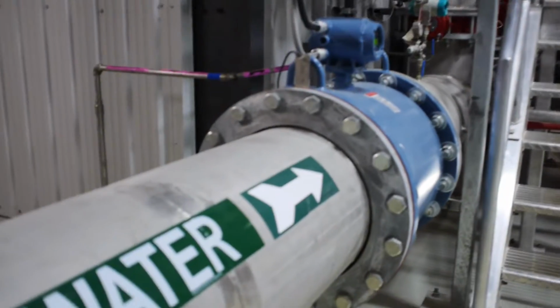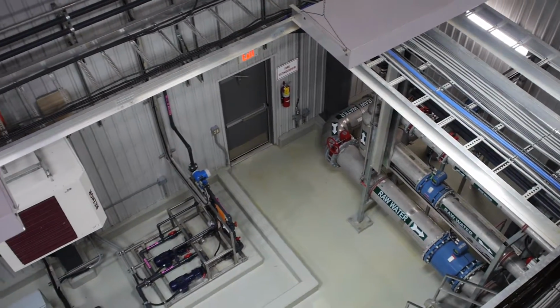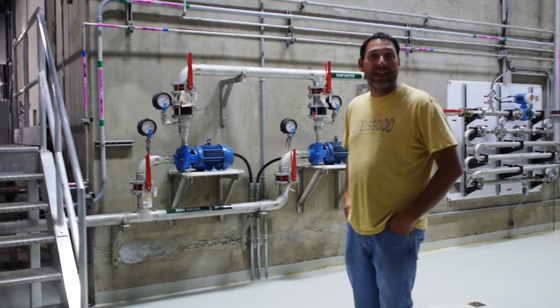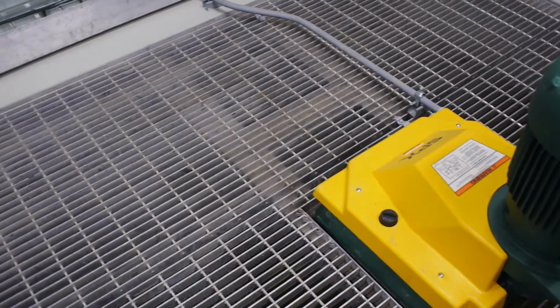How the system works here, the water gets pumped up from the South Saskatchewan River. It enters our treatment plant. We dose it with the chemicals that will be needed before clarification and during clarification. The water is then transferred through a mixing chamber and into a clarifier. The clarifier that we have built here is called the super pulsator. We have to do daily tests on it to find the happy medium for removing the sludge, the silt, the sand,